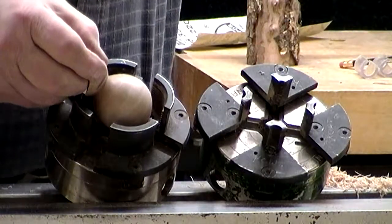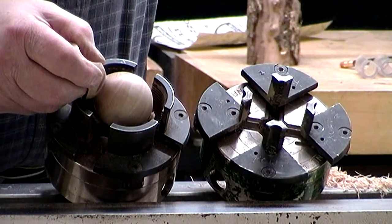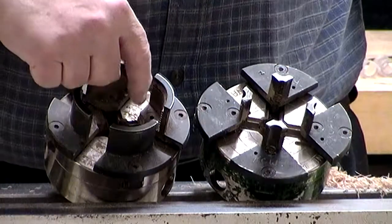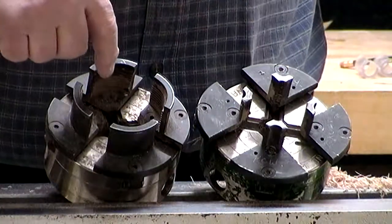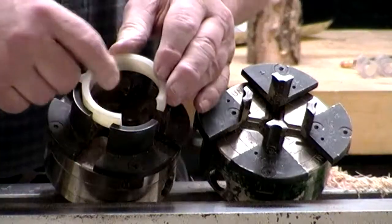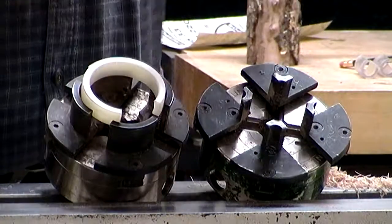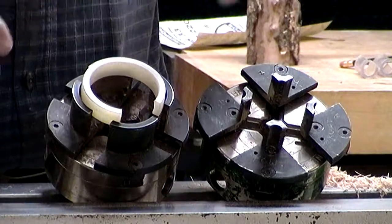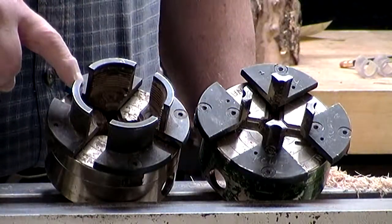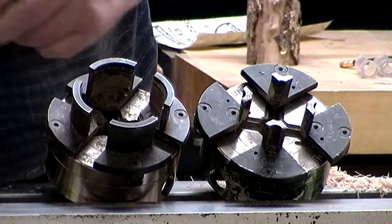But the alternative is this, and these are tower jaws made by One Way. When I purchased them, I really wanted the kind that One Way makes with a little double lobe on the inside of each jaw. Then when I put this inside, those lobes, twice on each jaw, would be touching this, and that's very efficient. What this does is this only touches in the corners, and that's inefficient. I'm going to try this one, see what we can get away with.